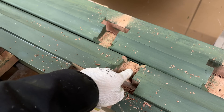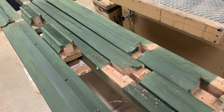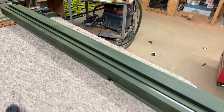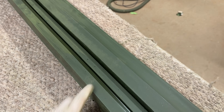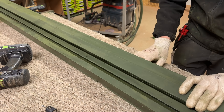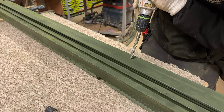I've just been around drilling some 6mm holes in the joint locations so I can screw this frame together when I've got the glue on and clamped. I can put a couple of screws in to help pull the joints together. Just got the last ones to do where this side light meets the open doorway, and I've got to pellet them in here in these finish faces so I can fill it nicely and it will all be hidden. I'm just going to put one in that moulding section there, hopefully my drill bit is long enough to guide it.